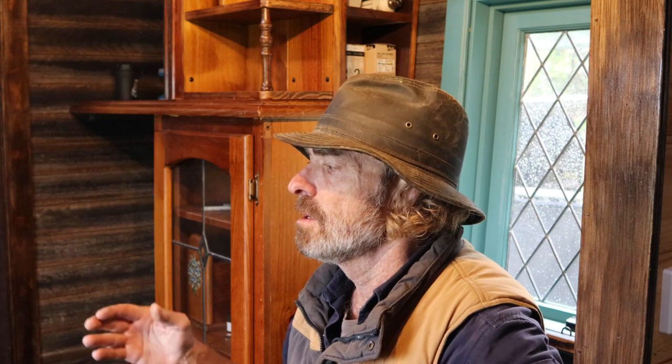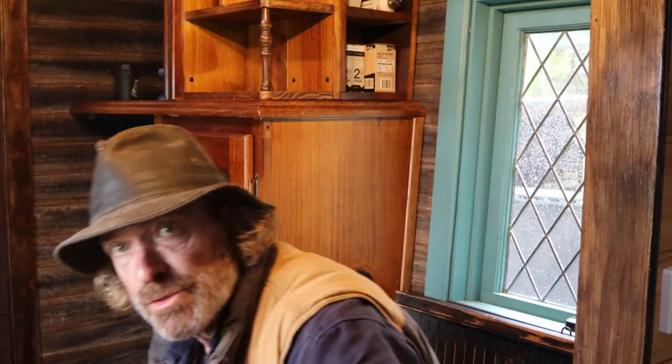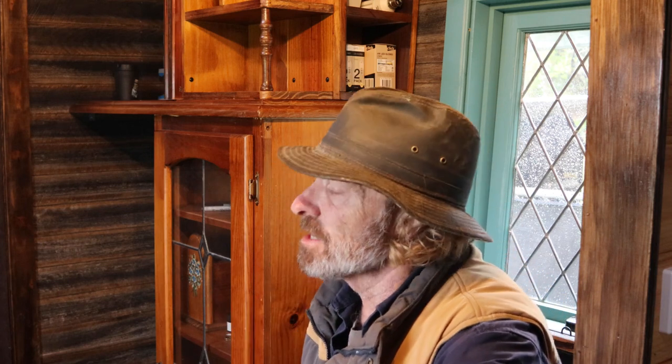My pressed metal tin at the back is cool or warm to the touch. Only where the top plate is back at the flue, where it's very close to the metal, it's quite warm. But even just traveling a little bit further down where the firebox is, easy to touch. The sides, easy to touch, cool to touch. And directly behind the triple skin, the exposed timber wall, cool to touch. Everything good. And now the triple skin is slightly warming up.